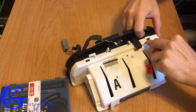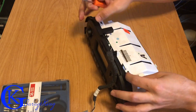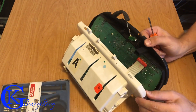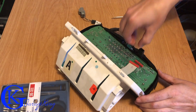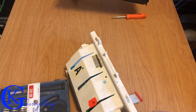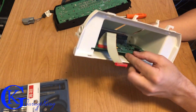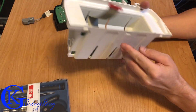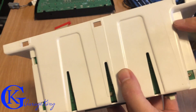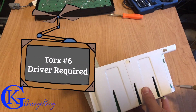There are two tabs at the top — use a small flathead screwdriver to get in. I've sped up the video two times so it really shouldn't take you that long. There we go, I just popped it apart. Now I'm going to grab this piece and carefully pull it up and disconnect it from the board, so now the two pieces are actually disconnected. We can pull this part out after we undo these tiny screws — it's a Torx number six.